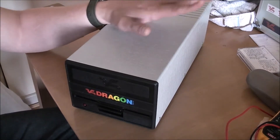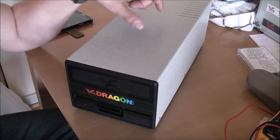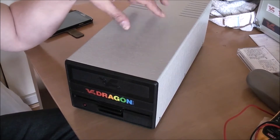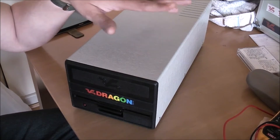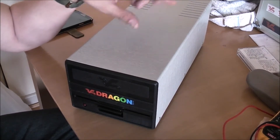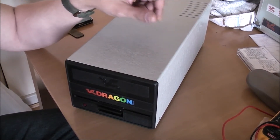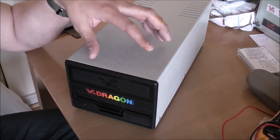So I pulled it to pieces. Once I initially moved the head it felt like it was stuck. I got it freed up, greased it and stuff, and it still wouldn't work. Looking closely at the stepper motor that controls the head, when it was trying to move you could feel vibration in the stepper motor. So I initially thought the stepper motor was dead or jammed.